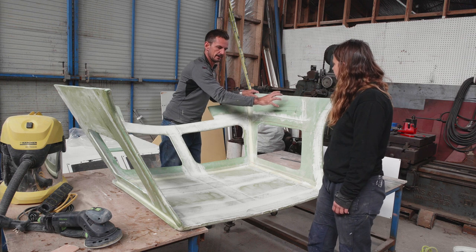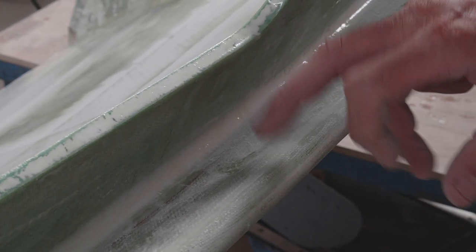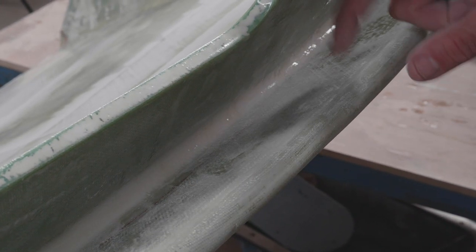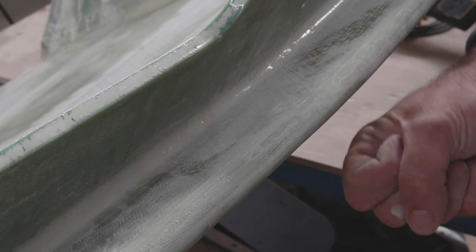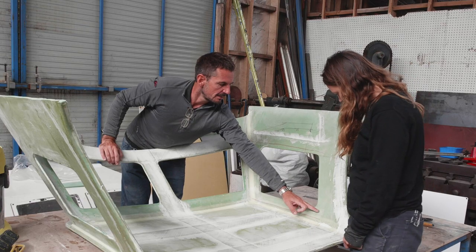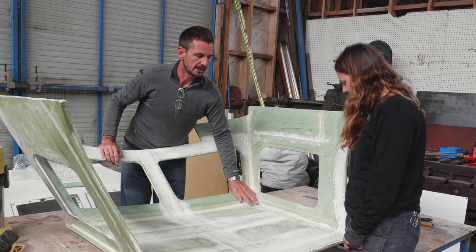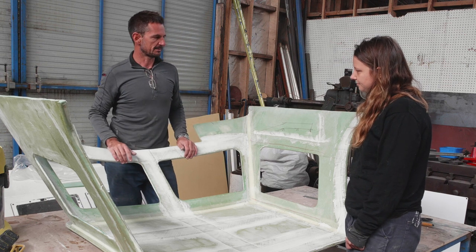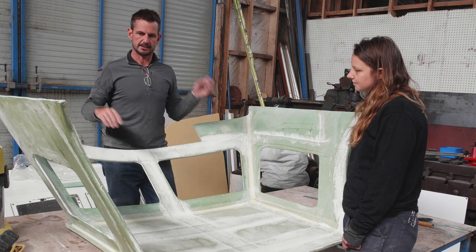Once all this is glassed into the boat, that's when all of these are able to cooperate to give us rigidity. Under here you can just see that red line — that's the 400 gram double bias reinforcing under this brow. The reason being is just in case we sit on the edge, we want that to be strong. I can't put knees or gussets in here because we're going to have that metal framework, and I want this slightly higher, just off the framework. That's why I've gone to the extra trouble of laying in that double bias.